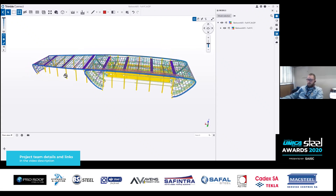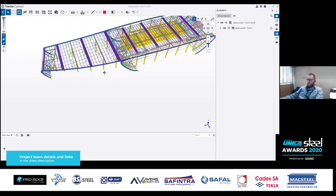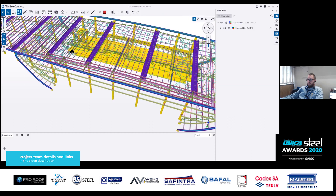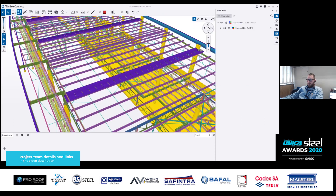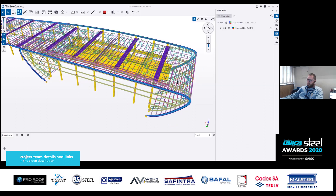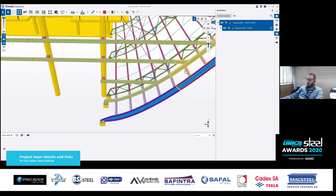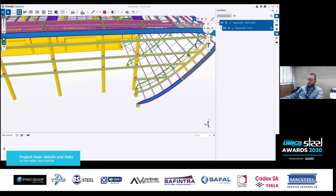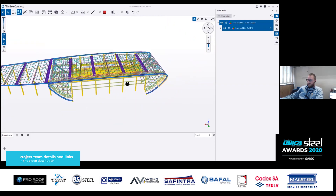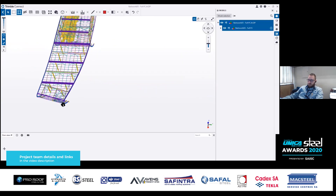This structure was curved in two planes and quite a challenge to fabricate and draw. The roof is pretty straightforward — a normal straight roof with internal gutters. But the facades on the outside were the real struggle, where we had huge assemblies with fabricated tubes and plates. We had to fabricate all these rolled sections from plates and make our own tubings to accommodate it. Getting everything to fit together and line up on site across all these different planes was definitely a big challenge.